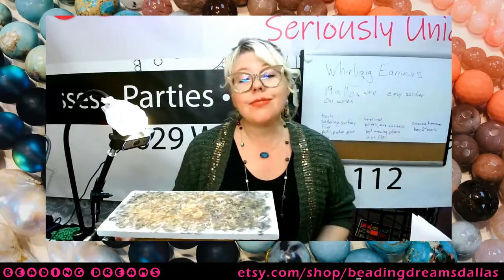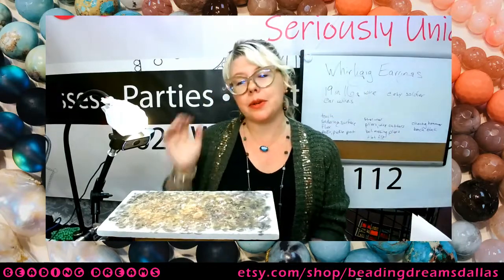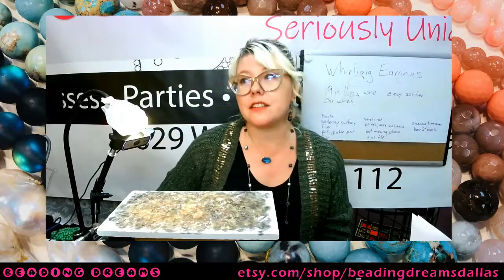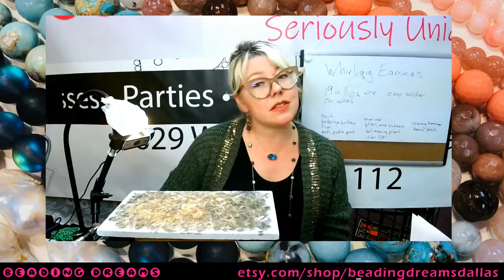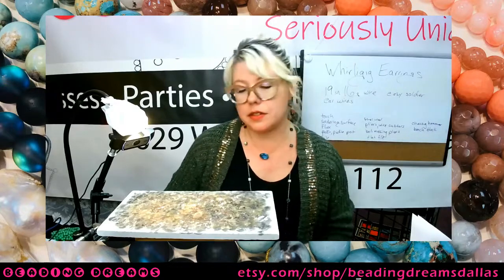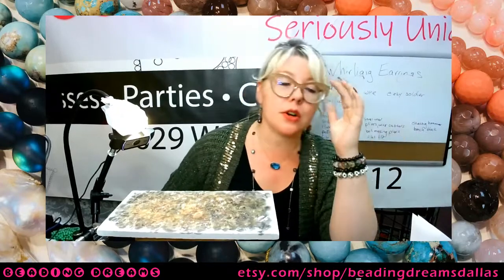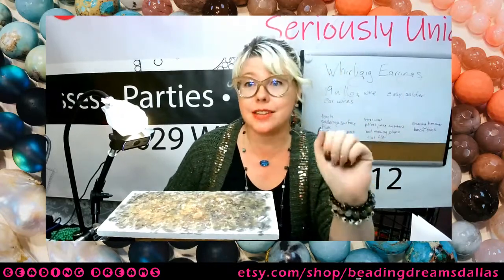Number two, once you have had a flame going in your workspace, from that point forward always assume that everything in your workspace is hot enough to burn you, because even though it doesn't look like it, a lot of things probably are. This is why tweezers are your friend when it comes to picking up anything that's been in your soldering workspace. Number three, ventilation is important.